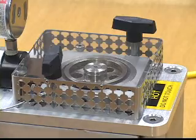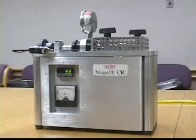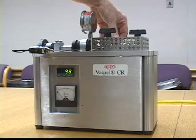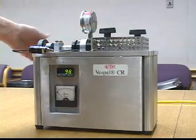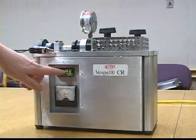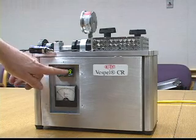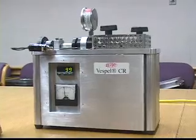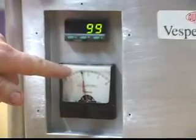I'm going to turn the unit off. We now have the rig reloaded with a CR6100 wear ring assembly. As you can see, the temperature is up a little bit from the prior run, but I'll start it up at no load. Again, we're drawing about 7.4 amps.